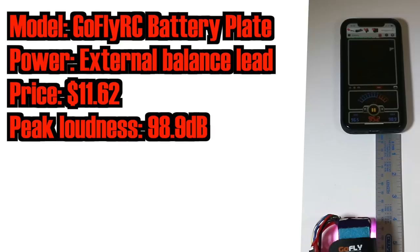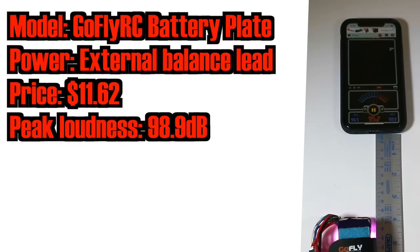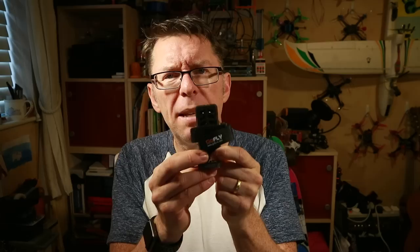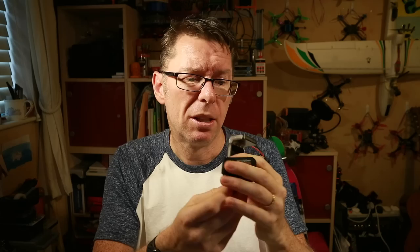In the wild and wacky category, a while ago I covered the GoFly battery protector — a multi-functional device with LEDs, a battery voltage readout via a 4S LiPo balance lead, and after seven minutes it would start to beep. The trick was you could stack the battery in such a way that if the battery disconnected it would stay connected to this and beep away — it was 98.9 decibels and came out before any of the cheaper Hellgate-style buzzers. At this point though, there's no real reason for it: Hellgate-style buzzers are much cheaper, and it risks pulling out on the balance lead, plus it adds more weight. Nice if you want extra lights and a voltage readout, but otherwise not really recommended.